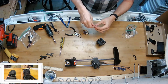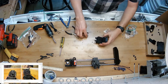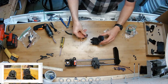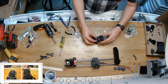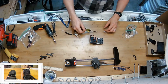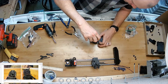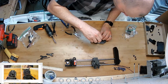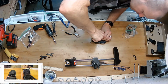And we will add that on later when we know exactly what the orientation of this shaft is rotationally, and when we connect it to the computer. And for now, there's an arrow on the top of this part. You'll notice that this servo is asymmetrical. It goes this way. Let's see, match that up, just like that. So the head of that is over the arrow, and then screw it on. And be careful with these little tiny screws. Tighten them all the way down, but then be wary of when the screw is seated, and not continue torquing it, because you can shear them off. They're so small.